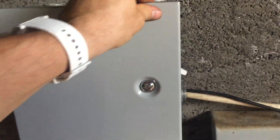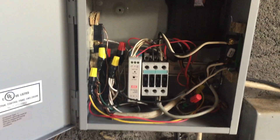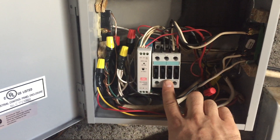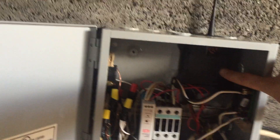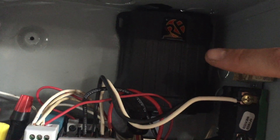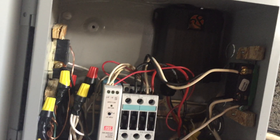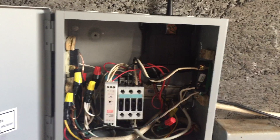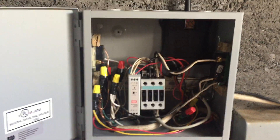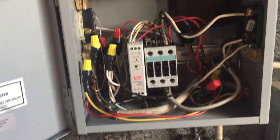Inside here we have the main relay — this is the big 220 relay that runs the pump, the well motor. Then up here we have an RF Solutions wireless control box that is originally designed for trap shooting to launch clay pigeons out in the field. It's good for about two kilometers, and we are just about exactly a quarter mile from here to the house we're controlling — well within range, although it is cut down a little bit because we're inside a cement room. It runs off of 24 volt DC.